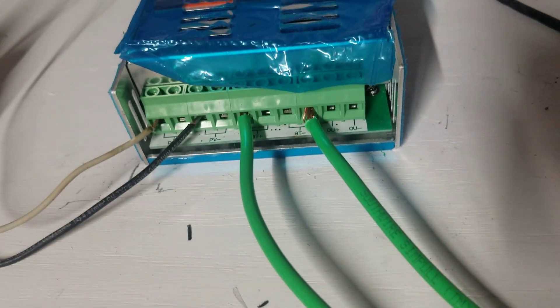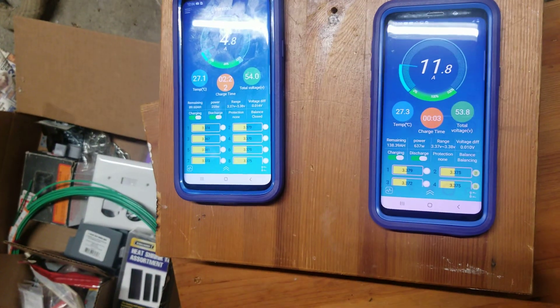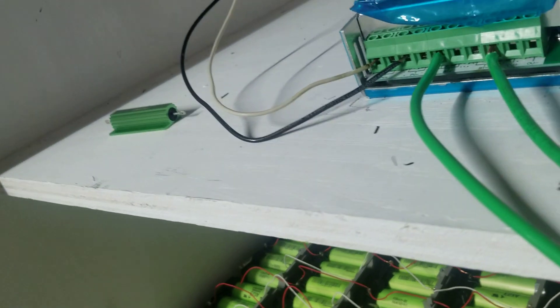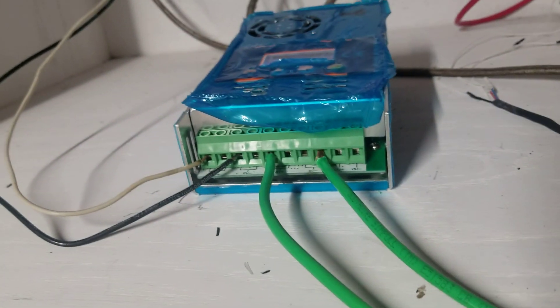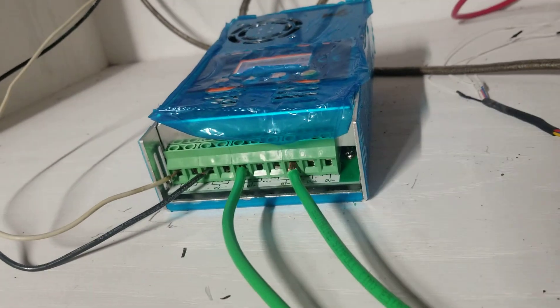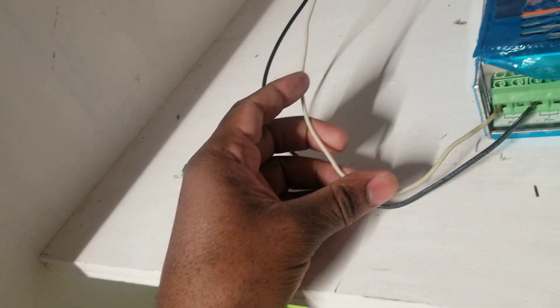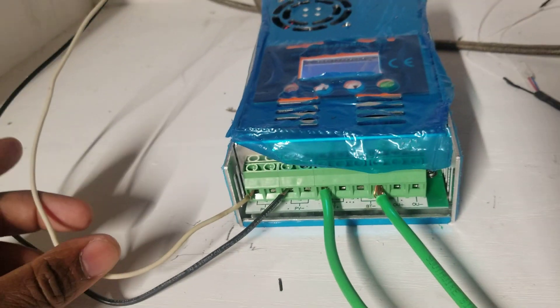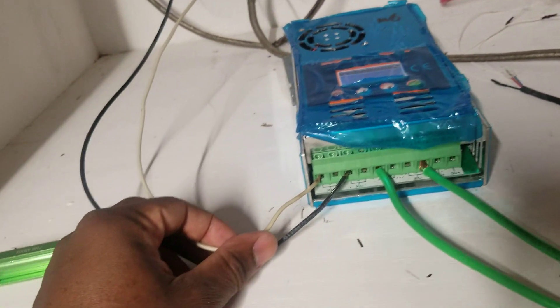The temperature of this wire is a little bit high. The inside wires are different gauges. I've got to shut this thing down before I leave. I can't believe it — it's a good thing I came here and touched the wire. This is not 12 gauge — that's what it is. This is not 12 gauge.